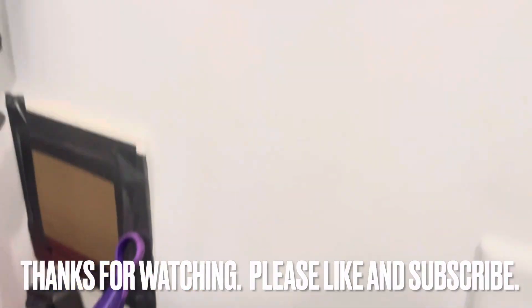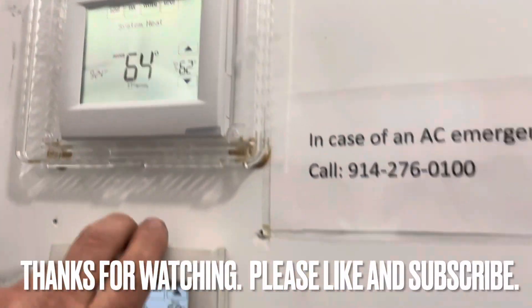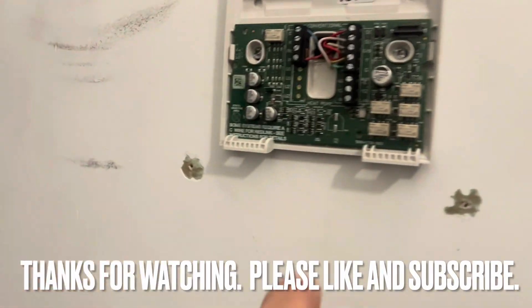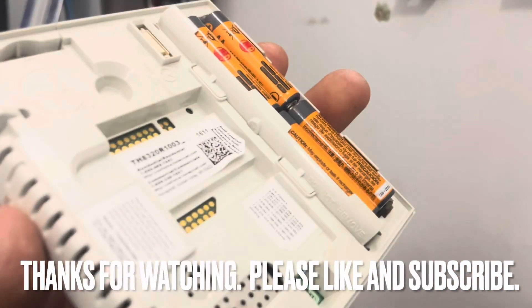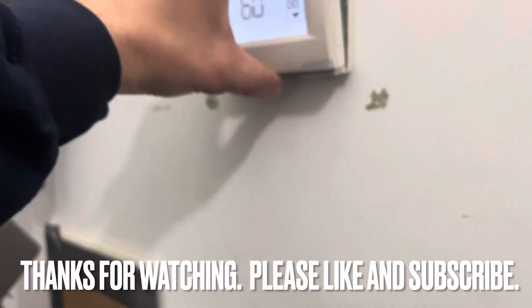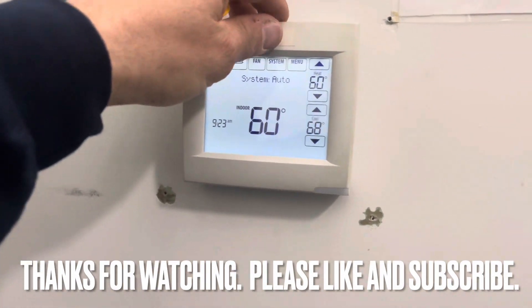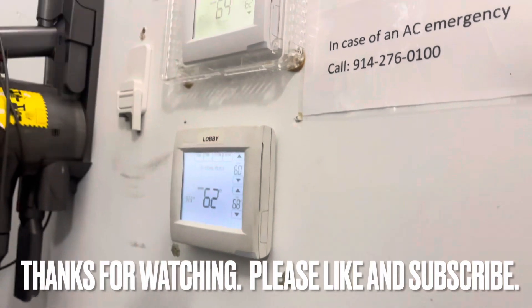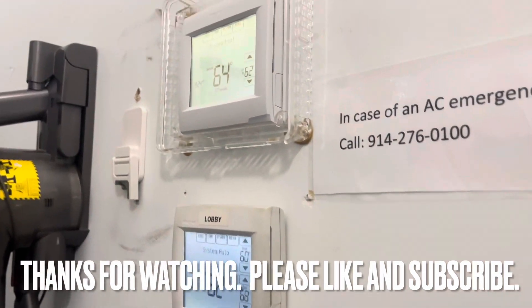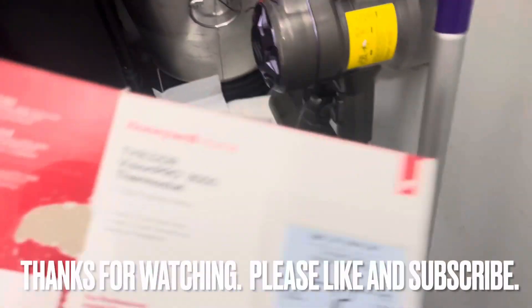On these you're going to need 24 volts, so you have to have a common hooked up. You need a common terminal in order for Redlink to work — it won't just work with the batteries. So it's kind of like Wi-Fi, but this is wireless — it's not Wi-Fi. If you have the Redlink device, you can also do Wi-Fi with these. But this thermostat right here is not Wi-Fi — it's only wireless.